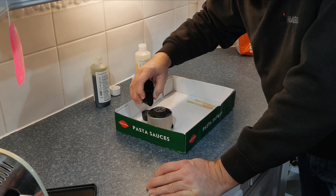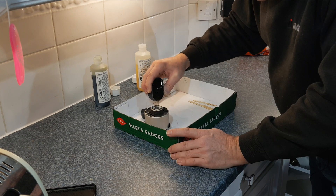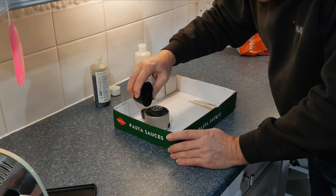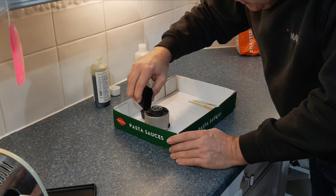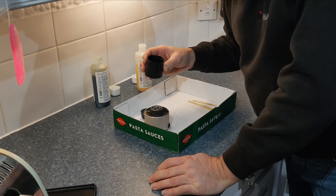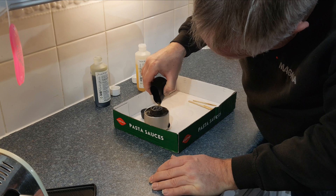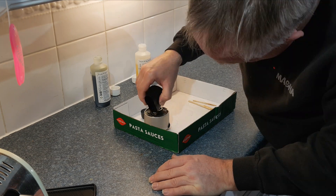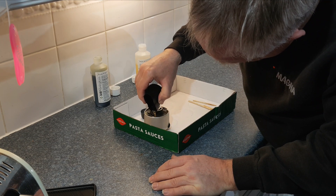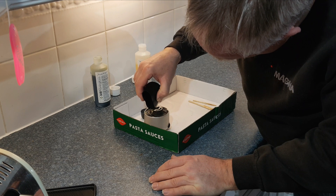That's about half full, so let that settle and put some in the other side. Fill up each side a little bit at a time, keeping pouring from the same point so the mixture can flow into the space. As it comes up towards the top, pour a little of the last batch across the full width — because all this time your rubber is setting and starting to flow a little stiffer.